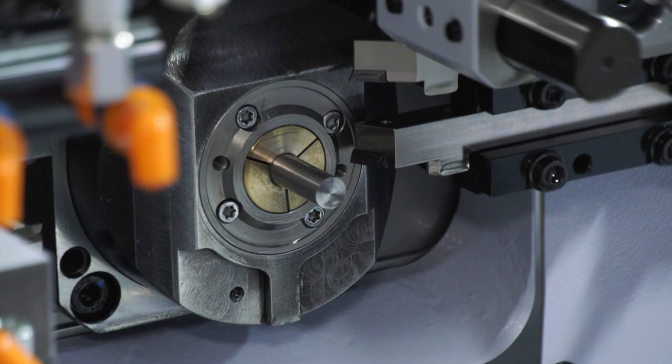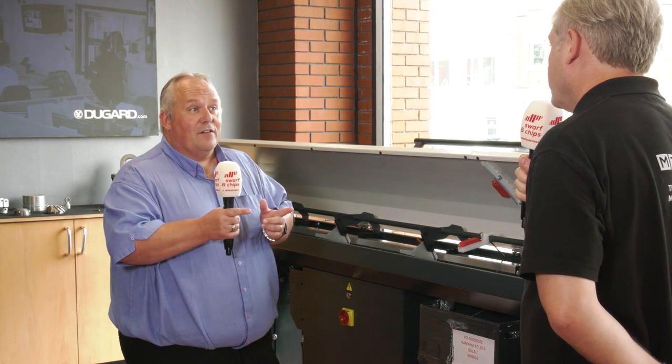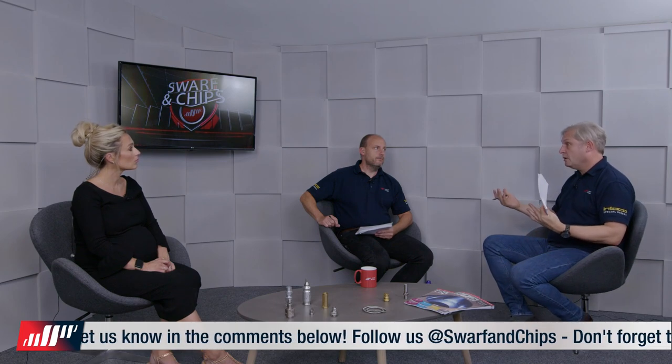These machines run in guide bush mode, but you've got the flexibility to go non-guide bush. There's a key difference in remnant length between the two. With guide bush, your remnant length will be the distance between the headstock and the guide bush plus one component — so on a 20mm machine with 205mm of travel, you'd have 205mm plus a component as your remnant. With non-guide bush, because the guide bush is removed, you can have a short bar end of around three to four inches maximum. Guide bush equals longer remnant; non-guide bush equals shorter remnant — critical when you've got expensive materials.